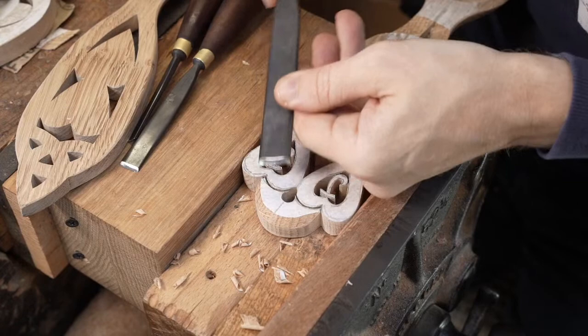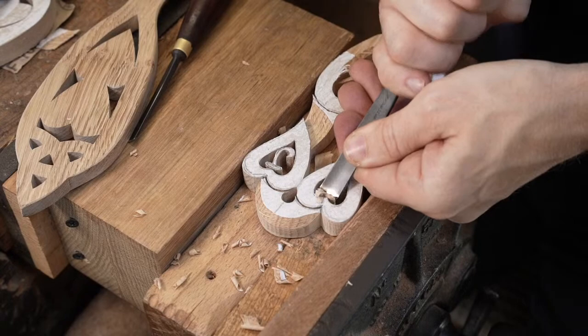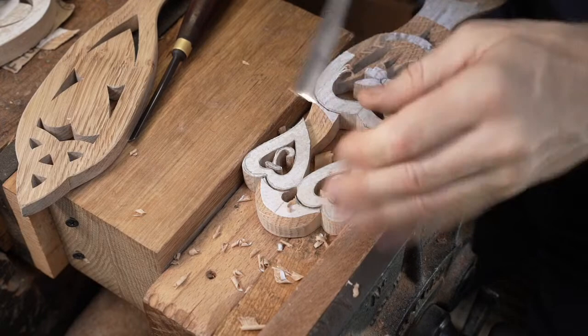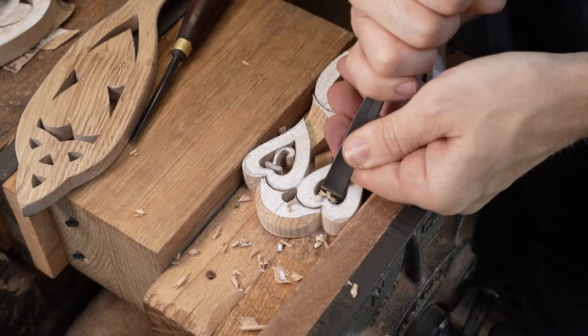And my two sons now, they're learning. One is 4, one is 6. They're learning how to wood carve. They don't even realise it, because they come in and they want to have a play on the bench. So we give them some gouges, some tools, a little project to have a go at. They enjoy it, but they are learning how to do it. The only things I ever tell them: both hands behind the blade, cut away from yourself, and make sure it is secured in the vise. So I set them up as safely as possible. Other than that, I just let them play about and do it.